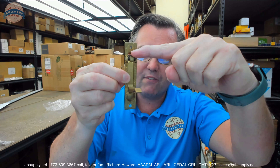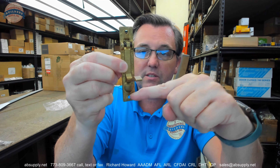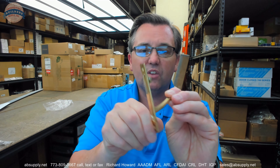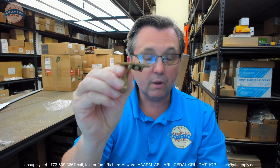What I do with this sort of thing is visualize what I've got to install: I know I'm going to have to accommodate this body in this area. I would go this height, basically the same width, and then to that depth we talked about earlier to fit the body in. I'm going to have to add the thickness of the plate to my depth, then mortise the plate itself — the four-inch by three-quarter — and the thickness of the plate, which is about 0.102 inches. So you're going to mortise that to the proper depth. It's that easy to prep for these.